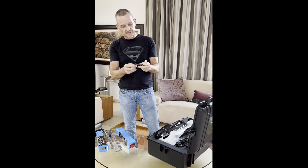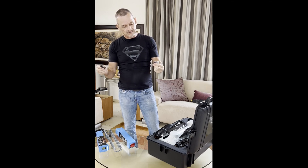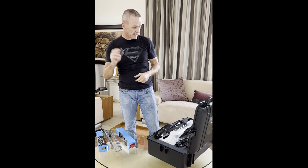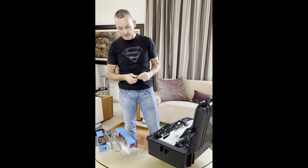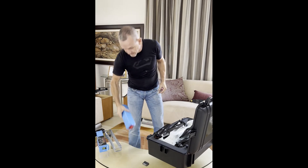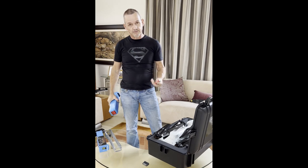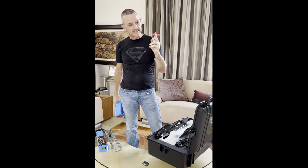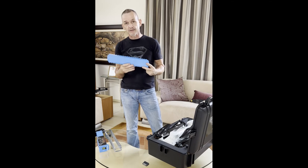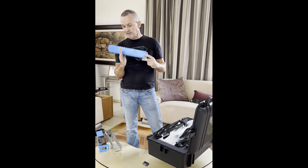That's the drone side and that's the battery side — it can only go in one way. This is a 120 amp connector, which is more than sufficient because at 46 amps this drone can fly with a 10 kilogram load. That's just because of the voltage — the voltage is so high. The battery of choice will be this one. It's made up of either of these two cells. The red one is a 3500 milliamp hour cell, of which I've put five in parallel and 14 in series, giving you 70 cells. This is quite a heavy pack — it is 25% bigger than the nearest competitor on the market, and that 25% goes not just to capacity but to amperage and power delivery.